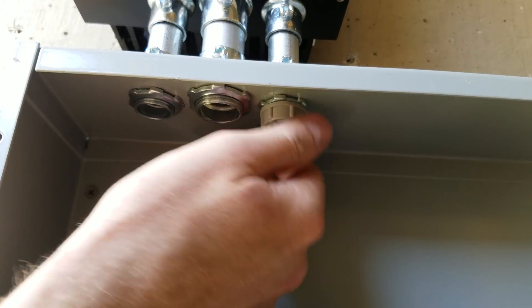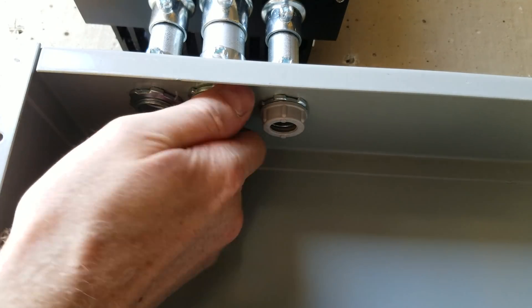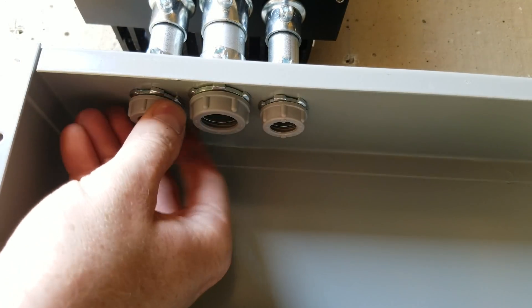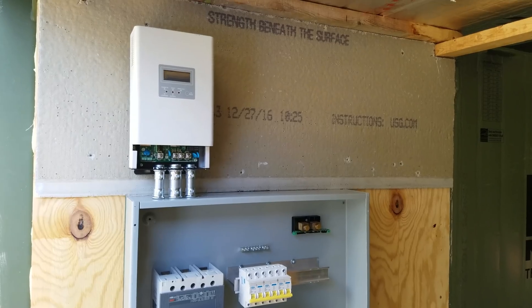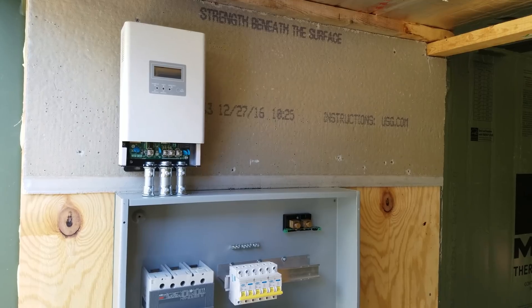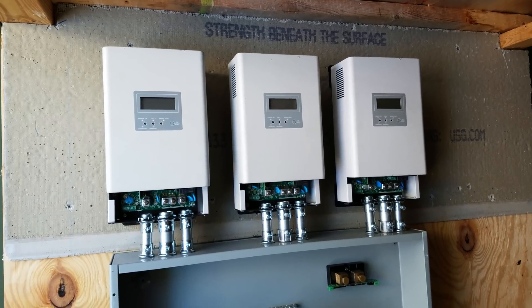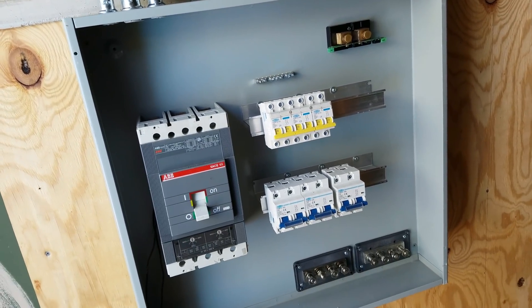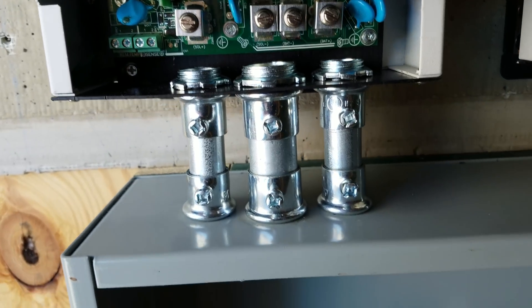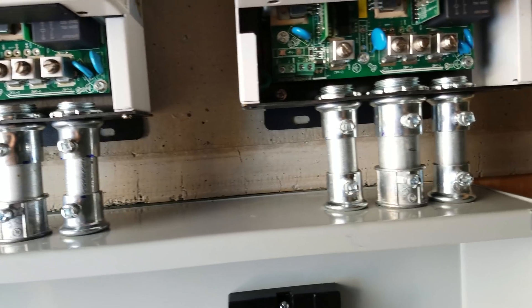Lastly, I'm going to put on these plastic bushings to protect any wire I may pull through these conduits. I'll put these on the bottom for now — unfortunately I don't think I'm going to be able to fit them in the charge controller itself, but we'll find out later. That looks pretty good; I've got two more to do and then hopefully we can start cutting the wiring soon. Here's the finished product — it came out very well. You can see all three charge controllers mounted and the enclosure mounted down below. Here's a close-up of the conduit fittings and the pull bushings. I need to get some more pull bushings for the other controllers, but this came out very cleanly and looks very good.